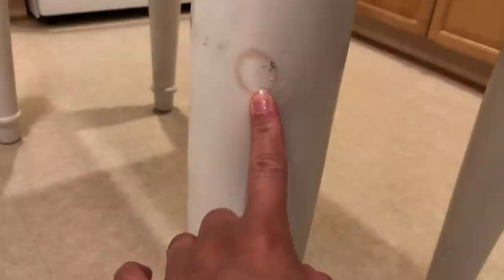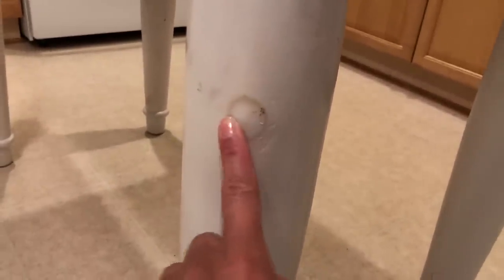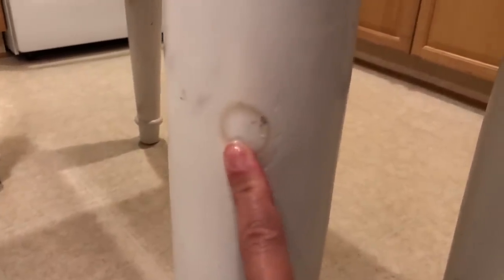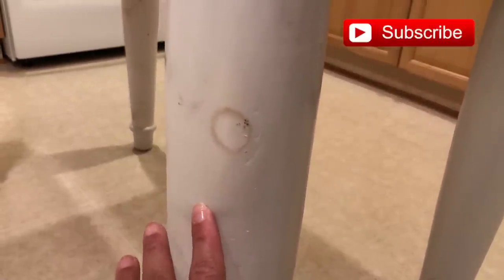This is what happens when you have a piece of wood that you paint over with latex paint, but it has a knot or an oil stain underneath — it will eventually seep through. You can see it right here. This is actually my very first furniture DIY — a little table that's super old and pretty beat up. I'm kind of glad I haven't redone it because here I can give you a prime example of what happens to a knot or oil stain under latex paint when you don't apply that oil-based primer.